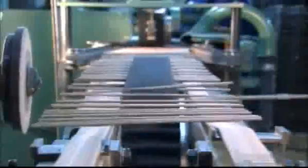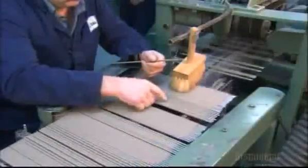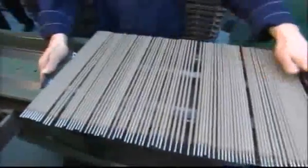When the coated electrodes emerge, they hit a metal wheel that positions them on a conveyor. A sander removes up to five centimeters of coating from the bottom, where you grip the electrode, and it bevels the tip so it conducts electricity even better. A worker now checks for uneven coating and to see if the wire is well centered.